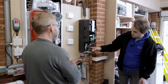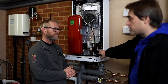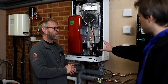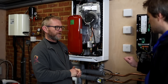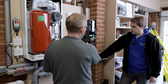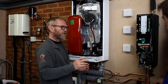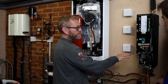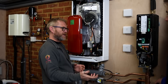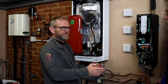The difference with this hybrid system is it will always run. Some hybrid systems, when it drops below a certain external temperature or the flow temperature doesn't reach the desired temperature, will shut off and the boiler comes on. This one just supplements. Which is why we need the hydronic separation between the two units. So there are two pumps: one pump here that can go straight through your system, and a second pump in the boiler. But that boiler pump is unable to run the system on its own because it will short circuit through the close-coupled tee if it ever tries.